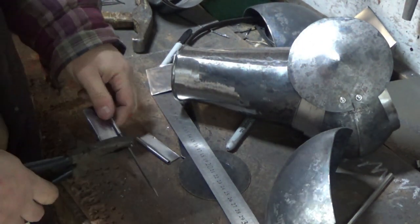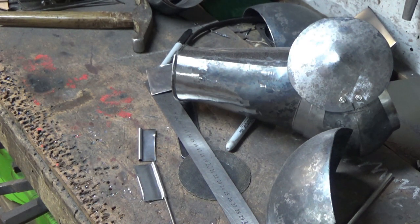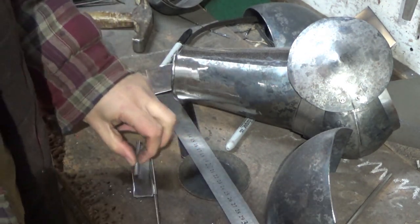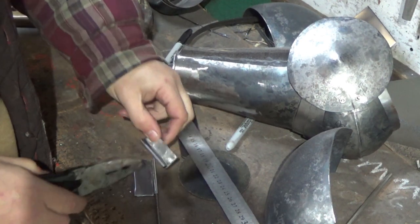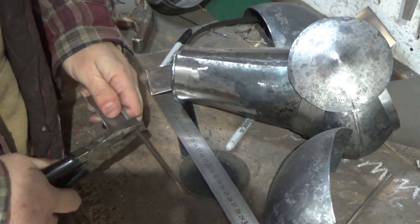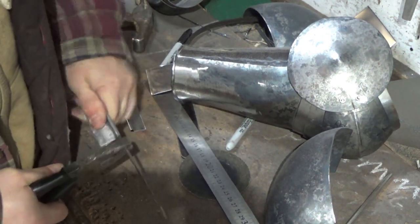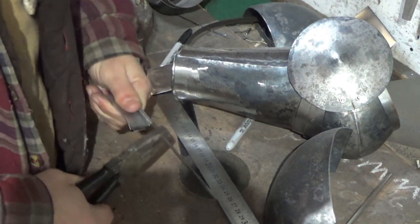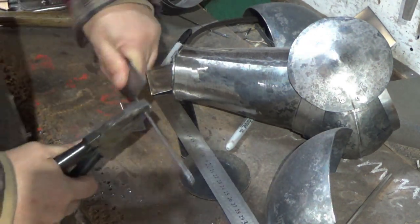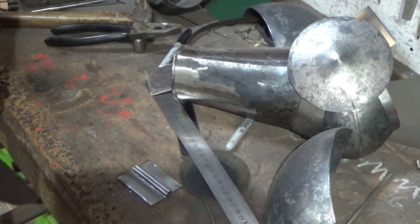So I've made the other one there. You can see I'm not too fussed about these being the same size - there's no need to worry about that. You can always tidy things up later. Just make sure you've got enough room to be able to put rivets in the mechanism. If you have a bit of trouble getting the pin out, I've found if you grab hold of the piece going through with pliers and work that bit, they come out easier than trying to do it the other way. There we go - got our two halves of one hinge.